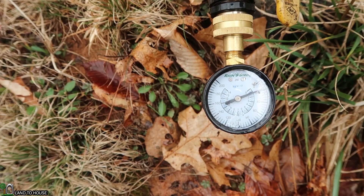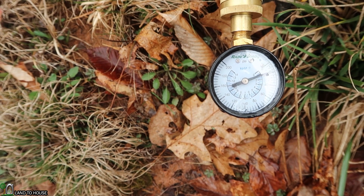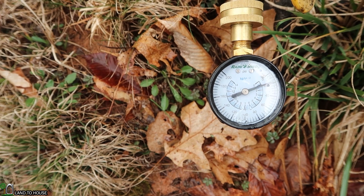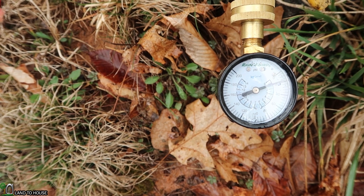So let's say we have 11 PSI down here at the water outlet. 11 PSI divided by 0.433 equals 25 and a half feet of head pressure — that's the drop from the tanks up here to where we're going to be using our water. Pretty cool. With 11 PSI there's a lot I can do when it comes to watering the garden. I actually have a couple of fun projects coming up with some sprinklers, so definitely stay tuned. If you've enjoyed this video, hit the thumbs up, subscribe, and hit the notification bell. On a side note: I let it sit until the tanks were full and now we have almost 20 PSI. Whenever the tanks are full, we should have enough pressure to do a lot of work watering our garden. Really cool — I like this a lot.